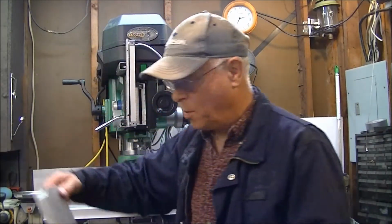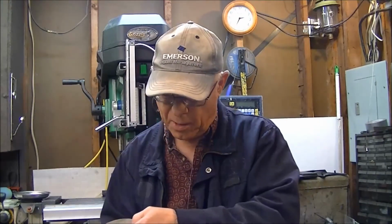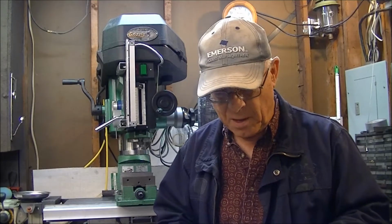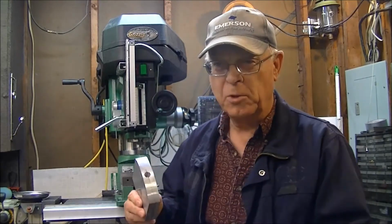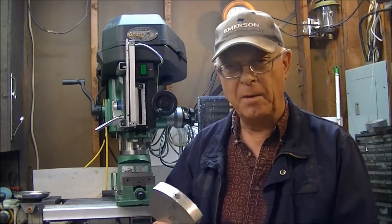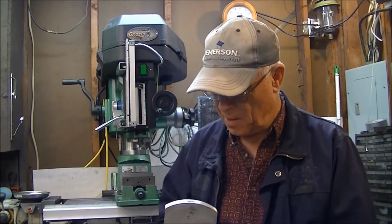I made this mold with this tall top because I was thinking I would put a little channel off to one side of the flywheel and maybe make one of the little counterweight things, crankshaft things like Mr. Pete had shown he had cast. But the first thing I learned was my hole was too small and I couldn't get enough lead in there, so I drilled the hole bigger, and that made a big improvement.